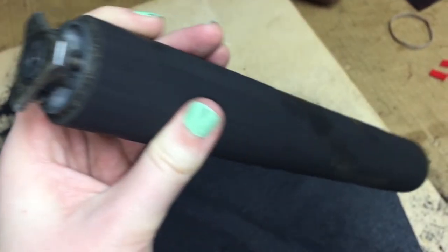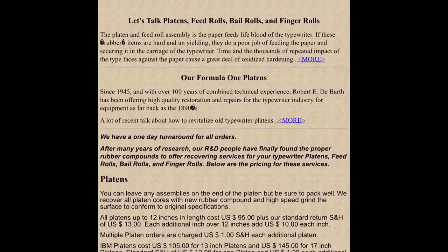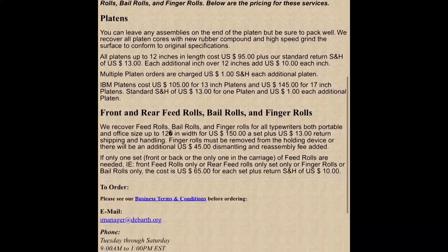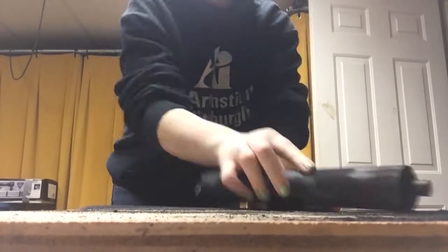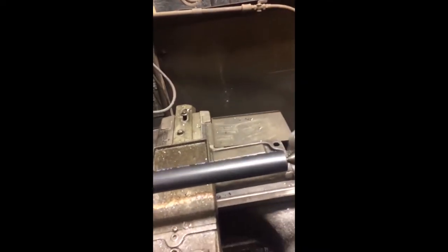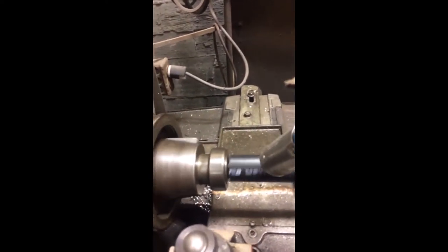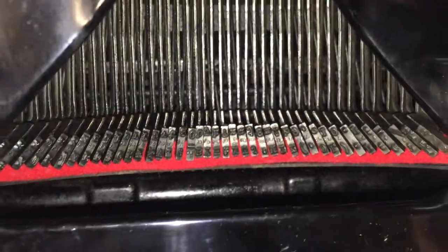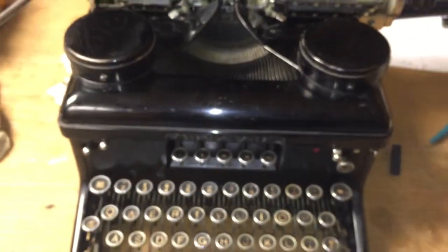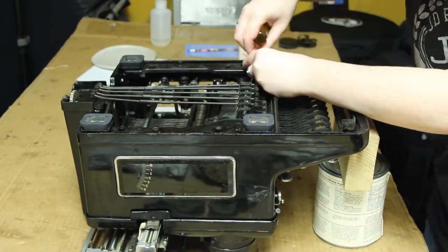The next task was to fix the platen. Ours had inconsistent lumps all over in varying heights, making it impossible for the paper to be gripped and roll through the machine. Replacements were too expensive and weren't really being made anymore, so we decided to sand down our platen until it was even on all sides and then build it back up to height using plastic mechanical shim, which my dad had at his mechanic shop. We also replaced the felt underneath the keys using some leftover piano felt from an unrelated project. From there, we found some replacement feet online and buffed the machine. With a new ribbon from Amazon, this baby was finally ready for a type test.